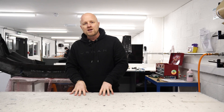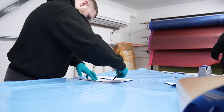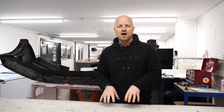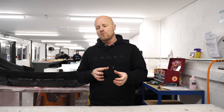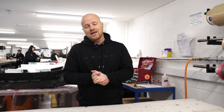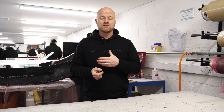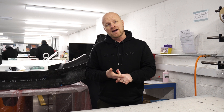Moving on to stage three — this is our kit cutting table where we cut the kits out of the pre-preg material manually. Early on in the R&D process this is done while we find our feet with how we want to cut the kit before creating a component by laminating it into the mold. The guys behind me are going to start laminating components for the RS3, and once complete we'll bag everything up into the vac bag and get it ready for the autoclave.